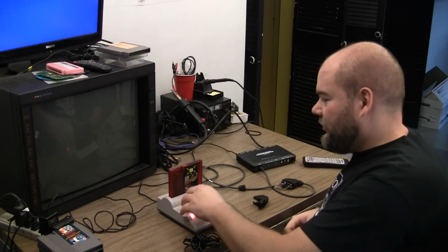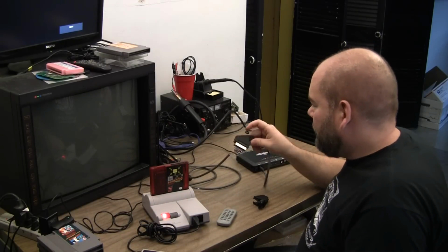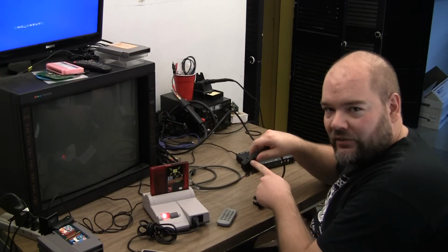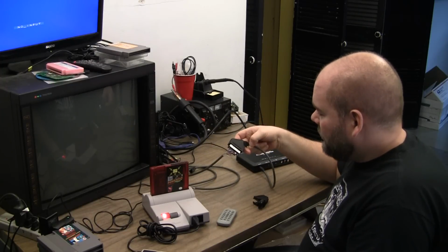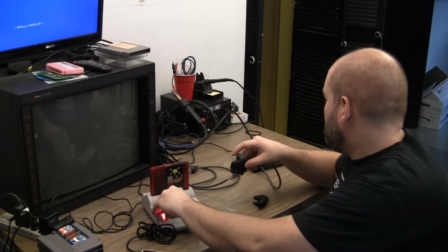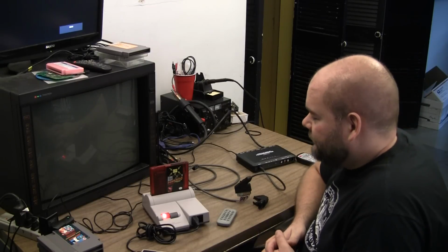Okay, so first test with the xrgb, and if you can see that in the camera, I'm getting the no input thing again. And if you remember, I put a switch on the adapter cord to bypass the sync stripper that's built into the SCART head of the adapter cord. But it doesn't seem to matter. What I do with that, I'm not getting an image.